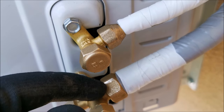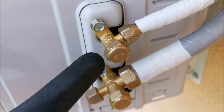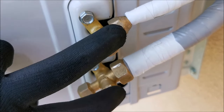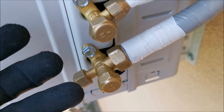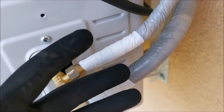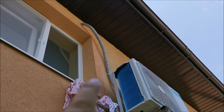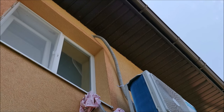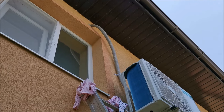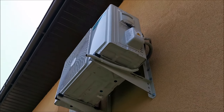Now I'm just putting back the covers. In theory I can plug it in and it should work. When I released the valve I heard the refrigerant going in, which is a good sign. Everything has been tested. Note: you could skip the vacuum pull without testing if you have less than three meters of pipe and you're only using the included pipes — in theory you're okay, but since we had the equipment, why not? On the other side of the AC we placed the putty-like sealant that comes with it into the wall hole so nothing can get in. Then put the pipe cover on and let's go inside and power it on.